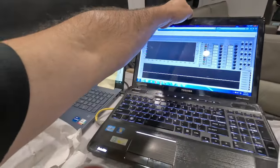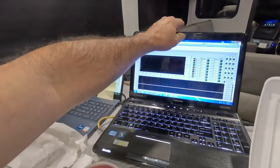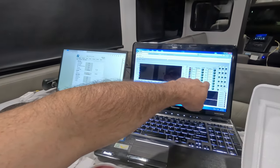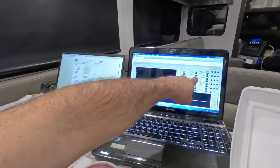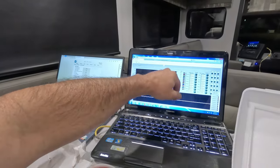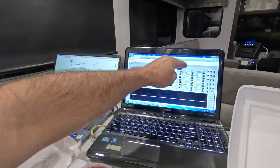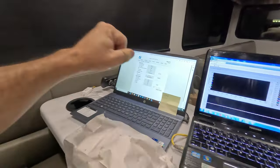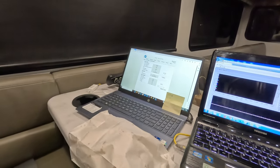We got all the goodies here that you can ask for. We can monitor our temperatures and our humidities. Humidity, 2 through 6 is in the bag. So humidity, they want under 60. Temperature, obviously they're not too horribly worried about it. I mean, obviously they don't want above 80, but we're not gonna be anywhere near that. The units are both set at 62. Reheat's only on one of them.